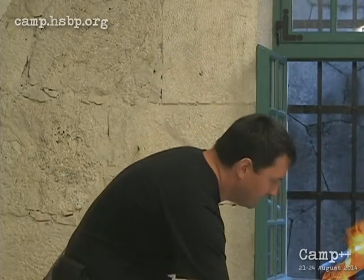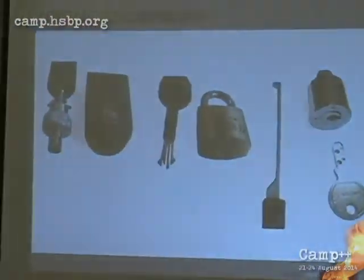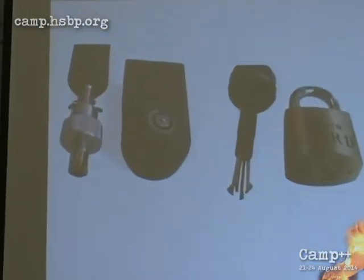One tool costs 150 to 250 euros. So you can imagine how much it costs for a locksmith who's opening safes, for example. Okay, the question is always for which lock you apply which tool, and what can you do if you don't have that tool. And here I can tell you, for example, there is this round lock. You can use the very special HPC, very expensive tool, costs 85 euros. Or you can build your own tension wrench for that.